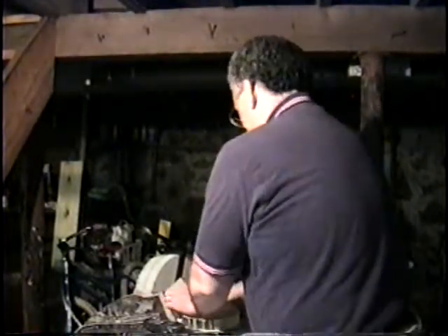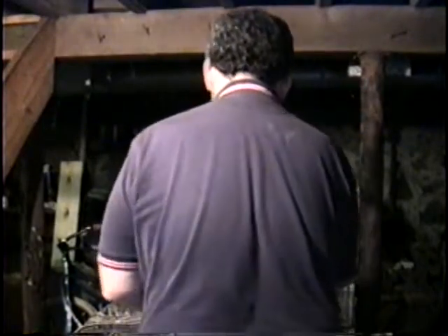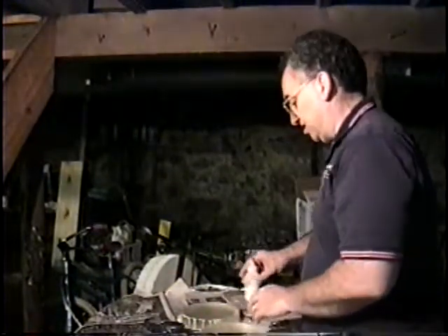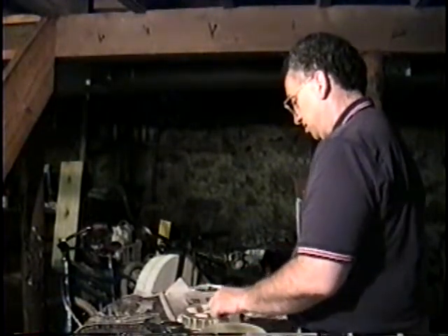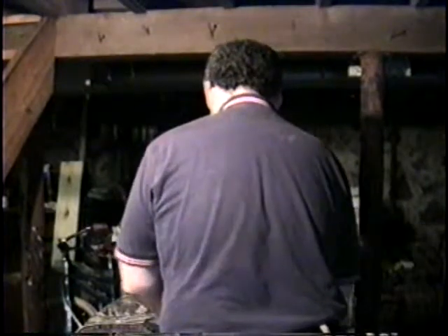The only thing that actually counts is while the glass is moving over the glass. So I'm going to give this a little extra time. I'm at 209, which is where I want to be. I'm going to stop, take off the glass — don't want to leave it hanging off the edge, that's a mistake people make and I've made it too. Now I'll recharge and grind again.